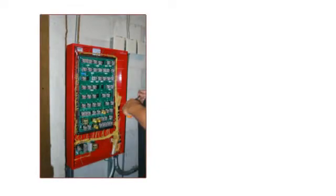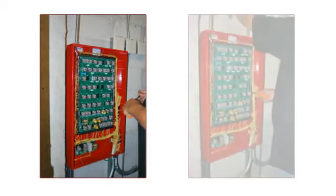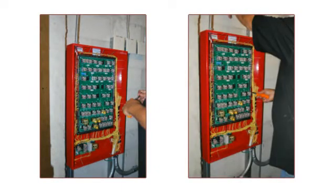You notice he brought all his conduits in at the bottom of the panel, so he's following our suggestion. Here it's in and wired. Again, the way he's wired this panel, by taking out the basic mounting screws, the whole panel will drop easily. He's left himself enough slack around it. Actually dressed it up pretty nicely. This was a pretty nice job they did. It's a little duplex system.